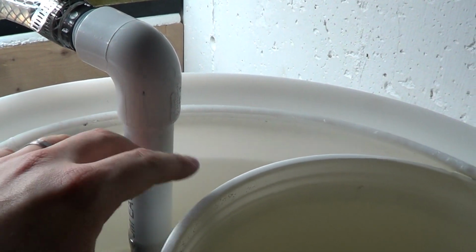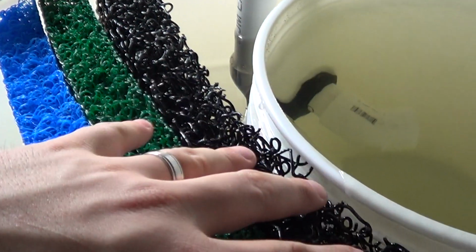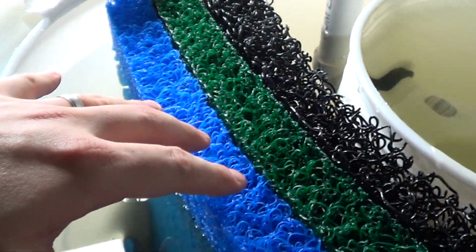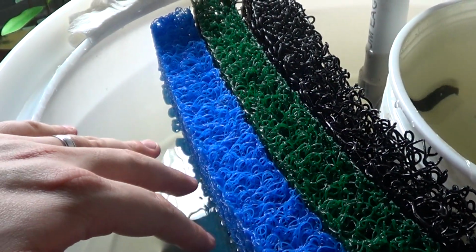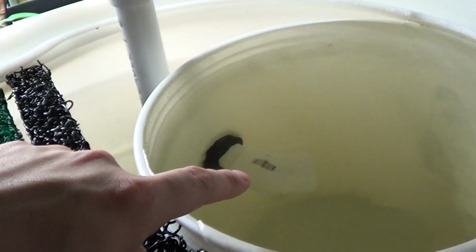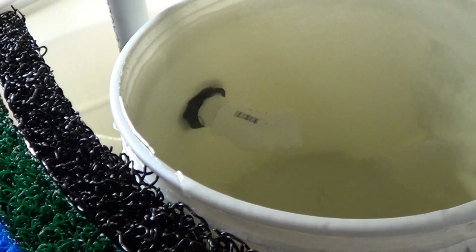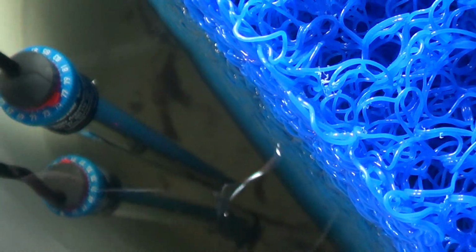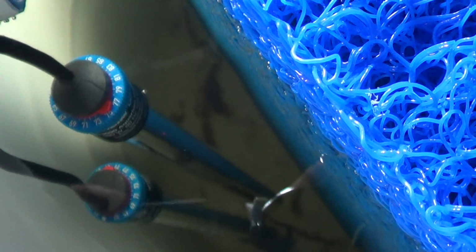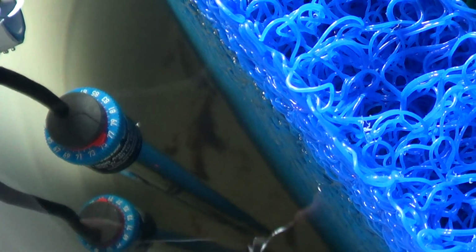And then if you take that amount of water and you divide it by the surface area that we have here, moving through to this side is much slower than the water that's traveling through that 1-inch fitting there. So that has actually allowed quite a bit of sediment. If you can see down there in the bottom, it's not going to focus, but there's quite a bit of sediment that's actually already dropped out on this side of the barrel.